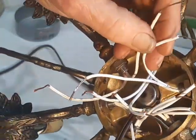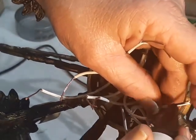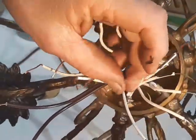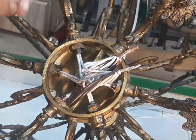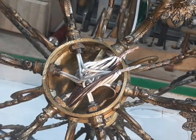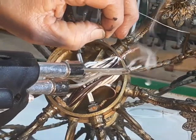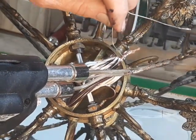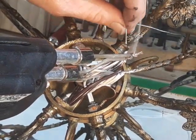It would be pointless to worry about which wire goes under which screw and then get them all mixed up down here. So to distinguish the smooth wires from the ridged wires, I paint a black stripe on one. That way, as I'm bundling them all together, I can keep them straight without having to rub my finger across every wire over and over again. Now I have all the smooth wires bundled together and the ridged wires bundled together, including the brown trunk wire coming down the main pipe, and I'm going to solder them all together. All connections in the Secret Underground Laboratory are soldered — do not use wire nuts, do not use mechanical clamps, and certainly don't just twist the wires and wrap them in tape.